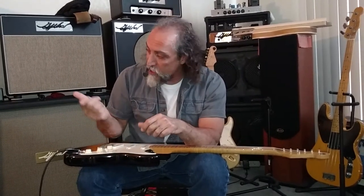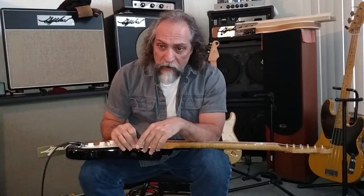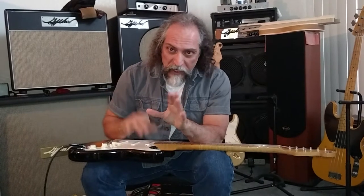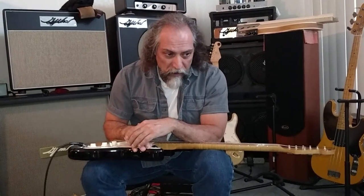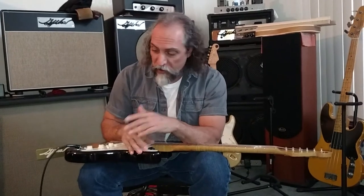And if you put a meter in your wall at those times of day, you can see some really high voltages, because as hard as those guys can work, it takes time to knock down these grids. Early in the morning, you have the same problems. By the middle of the day, you should usually see the same thing out of your wall all the time. But now you go to a gig, you go to the club, you don't know what's there. People just go and plug in.